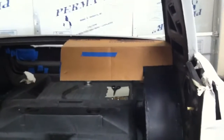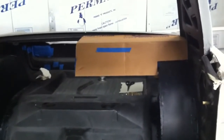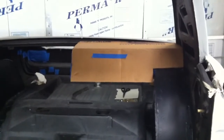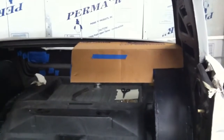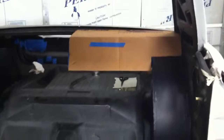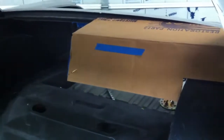Reproduction ones aren't cheap — about $200 — so we decided to make one. We're going to make this out of 18-gauge sheet metal in two pieces: a right side and a left side. The first thing we did was make one side and create a cardboard template to get the fit right, using that as a starting point. We also made another cardboard section that attaches and comes down to cover that area — that's kind of the first step.